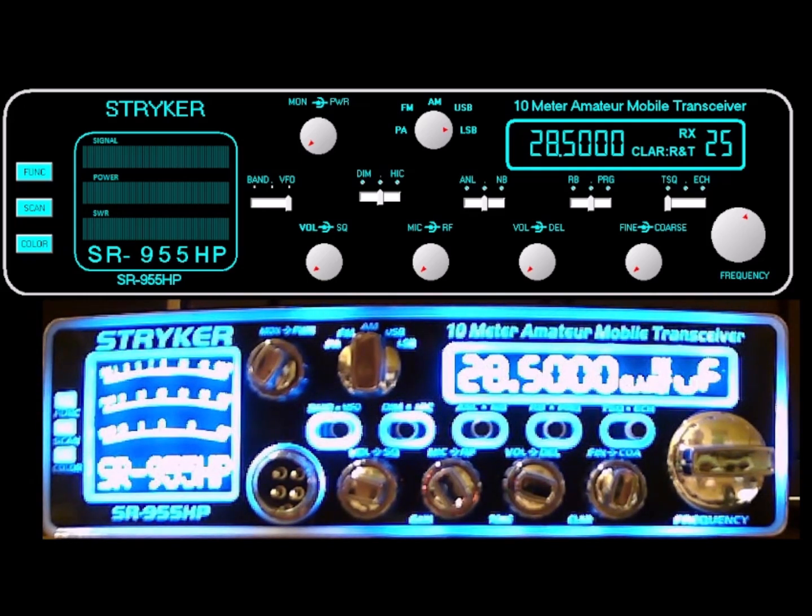It's a very proprietary protocol and I'm sure they just didn't want to hand it out to everybody — and I will respect that. It is so complex that to make sure everything was operating properly I basically had to make my own virtual radio, and that's what you see on top. I've drawn it to be as close as I could to the original, which is right below it. All of the buttons and switches — including the channel selector, mode switch, band, VFO, dimming, ANL noise blanker — all work and do exactly the same thing as on the radio. I've also decoded the packet so I update the display values: frequency, channel, clarifier, TX/RX, signal meter, power meter, SWR meter, and the eight alphanumeric digits — all decoded and showing exactly the same thing as the radio.